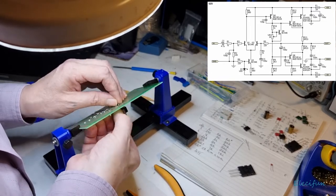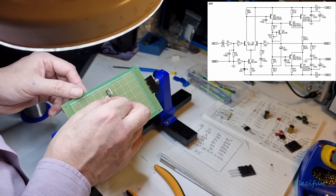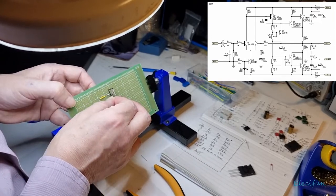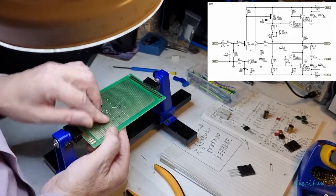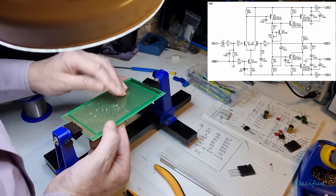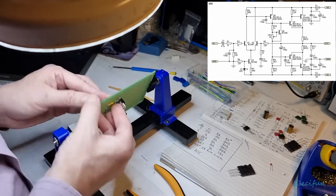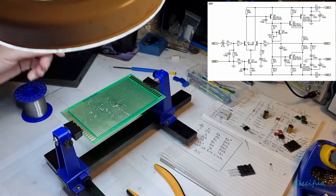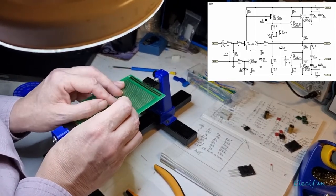All right, so I can get this out without too much faffing. I think then we want to still be there, right at the right place there, just one more in, back there and the straight leg there. All right, nice short leads again on the capacitor, and I'll get that to go on there, and this one just wants to go onto our base. So that's nice. And for this, I'm just going to use this little stick just to neaten up that bend there.